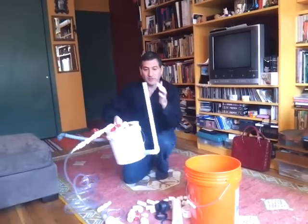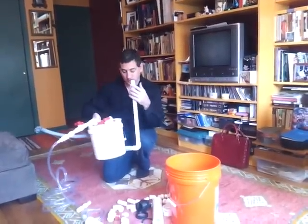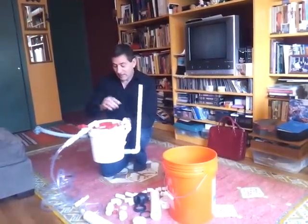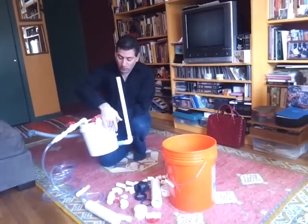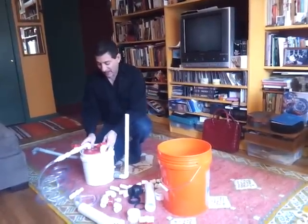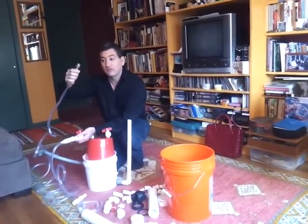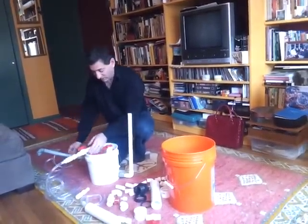The way it works is simple. When you feed ground-up food waste — I use an Insinkerator food waste grinder — into a digester that's been seeded with cow manure, horse manure, or humanure as the bacteria supply, the bacteria eat the food and produce methane gas. The digester bucket is filled with water to the top, and the gas collector is immersed in it. With the valves closed, as gas is produced, it raises the floating bucket up as it fills. Then you open the valve, the gas goes through the tube to your stove.